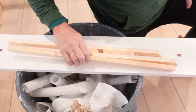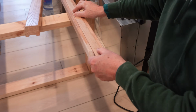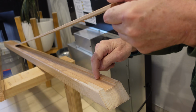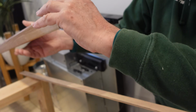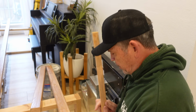And in fact, the handrails we bought, they're right here, they came with this strip of oak, and it was tacked right here underneath the bottom of the stairway. And that's exactly what these are for. This is a 1 1/4 inch dado. So what you would do, this would go upside down. You'd put your balusters in there, and you would space them with pieces of this. So we chose not to use this.